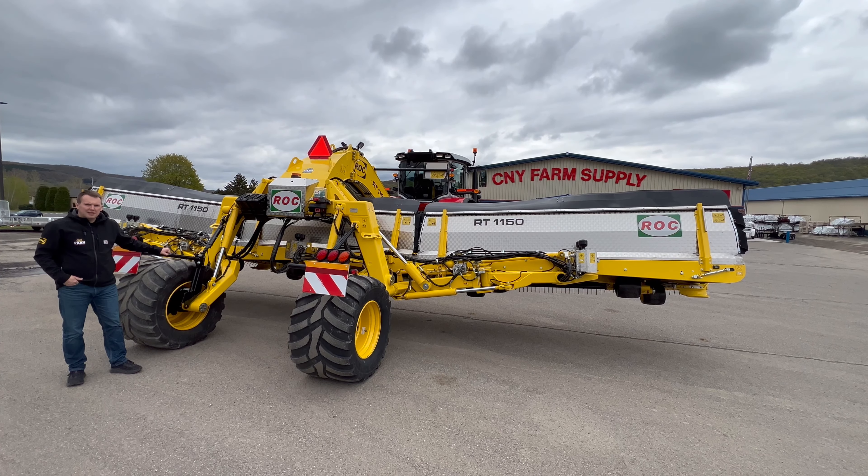There's a little cheater hole on this back silver box — it's easy to access. Here's a close-up of a valve that's very similar to the one that's behind that little cheater hole. What we're going to do is release this 15mm lock nut that's holding the valve tight, and then we're going to unthread this valve a little bit with a 4mm Allen head.